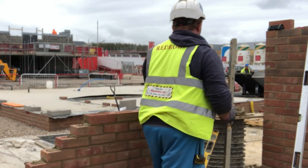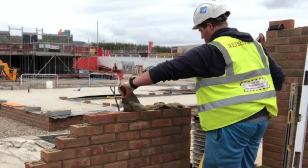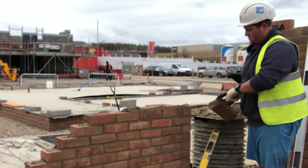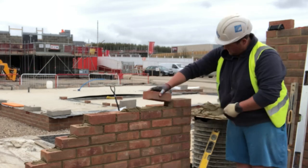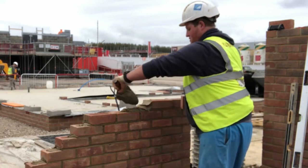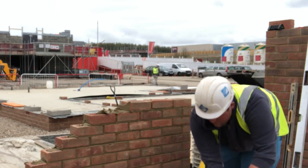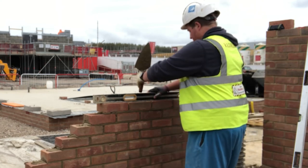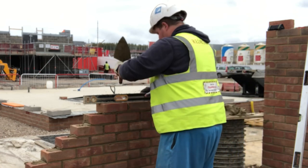You're staying in one spot, but you're still building the corner and laying quite a substantial amount of bricks without moving from one spot. As I said before about the dry bricks, jointing becomes a massive hassle, so every four courses I was jointing up on the corner, and the same again when I was running in. I've got footage of both corners building today — I started recording around the middle of the corner so I could get about four or five courses on camera. It was showing different methods of traditional corner building. On the iMovie software I'm using right now, the recording dial is basically covering up what I'm doing on the video, so I'm a little bit blind to what I'm actually doing.